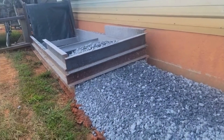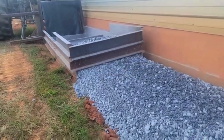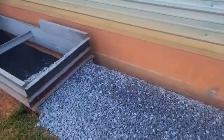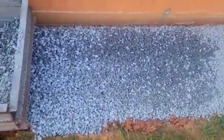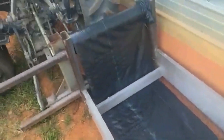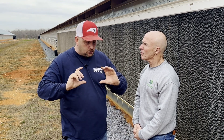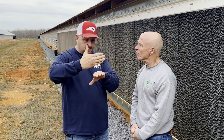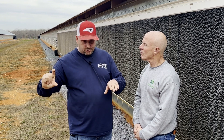So what I did — I just began to think about it, and the concept kind of came out the way a box blade works. You can take a box blade and gravel goes in through the front, and according to where the height is, it can come out evenly out the back. So I measured off the house, the width that NRCS wanted, and I created a box. Then in the back, I used five-inch C channel on the bottom, and then across the back of that five-inch C channel, I welded a piece of four-inch C channel.